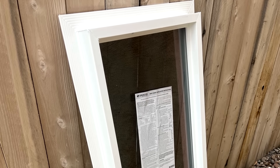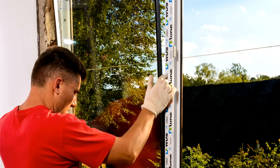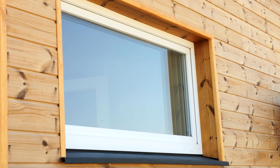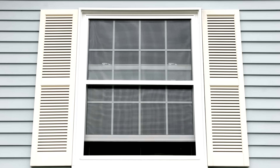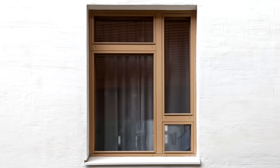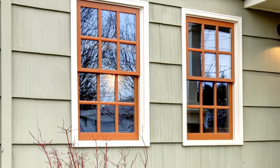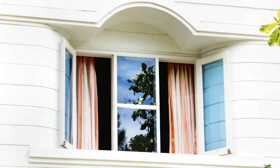In terms of windows, we have the option of either using a more typical flanged window, or we can go with a European style flangeless window. Both can be made to work very well, but a flangeless window gives you a lot more freedom in where you can locate the window unit within the rough opening. A flanged window is intended to be installed flush with the surface of the WRB and the exterior sheathing. There is some discussion about whether it's better to have windows inset — sometimes referred to as innies — or installed closer to the exterior, called outies. Unless the wall assembly is quite thick and you have an extreme temperature gradient, it actually doesn't matter too much where you locate the window from a thermal perspective if you use good thermally broken windows. Focus more on water management: inset windows provide more protection at the head but increase exposure at the sill, whereas outie windows are less protected at the head but more protected at the sill. If we're flashing and draining these components properly, both strategies can work just fine.